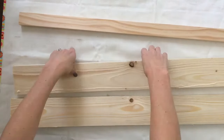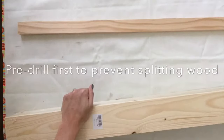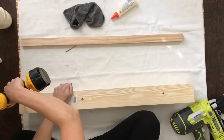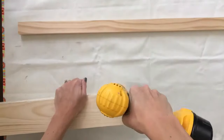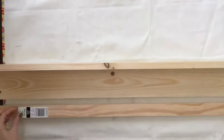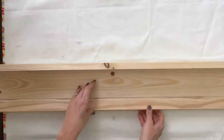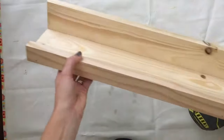Adding wood glue to what will be the back of our ledge. Using a clamp would make this part easier. Pre-drilling first and attaching one and a quarter inch screws — I started on the left and jumped to the right, pre-drilled and attached my one and a quarter inch screws, attaching five screws total. Now on to the front lip: wood glue first, then using a nailer with one and a quarter inch nails. If you don't have a nail gun, a hammer and nails will work too.